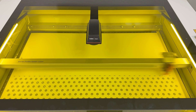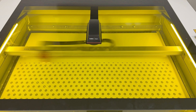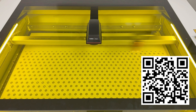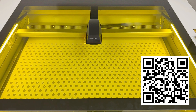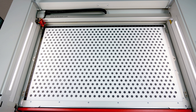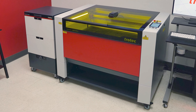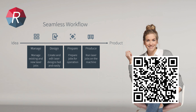Now that the machine is installed and operational, it is time to create a calibration mat and calibrate the overhead camera. Begin by placing the provided plastic sheet into the laser cutter and removing the protective film — the exhaust system will create a vacuum in the cutting grid, ensuring the sheet is held securely in place. For detailed Ruby instructions on calibrating the overhead camera for all lenses purchased, scan the QR code or use the link below. Remember to keep this calibration mat after completing the process, as it will be needed for any future recalibrations or when calibrating additional lenses.